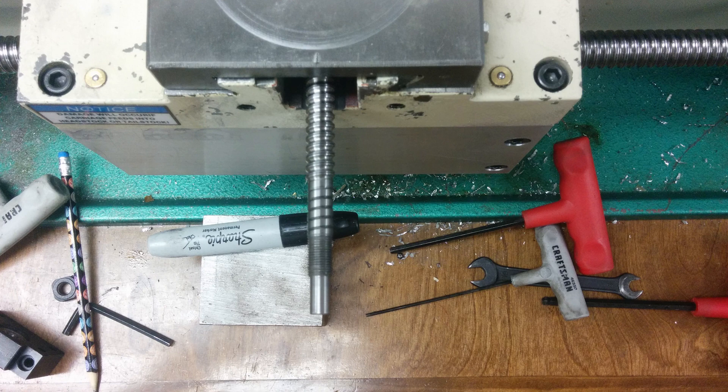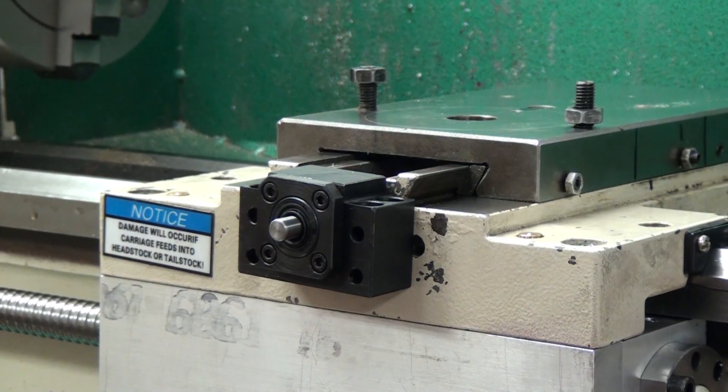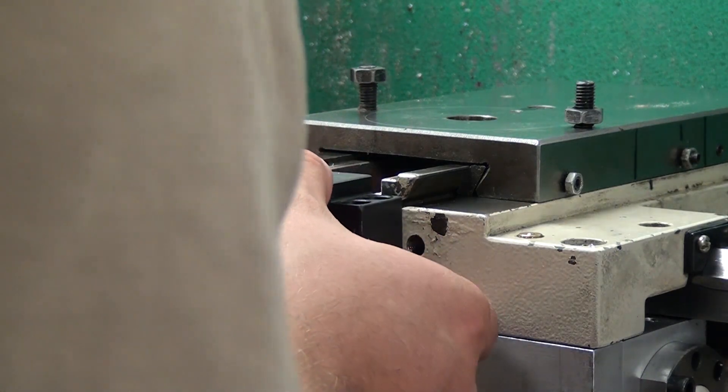When I was trying to get this perpendicular to the front of the carriage, I tried a bunch of squaring methods. But what I ended up ultimately doing was just kind of using my eyes and sighting right down from this angle and trying to make sure it looked perpendicular. I tried to take as many measurements as I could - I don't actually have a machinist square or any kind of precision square. When I did try to square it, it looked wrong, so I would go back and eyeball it into position. That's what I ended up going with, and it worked out great. I could tell because my bearing block on the back of the lathe - the location of that bearing block - turned out great.